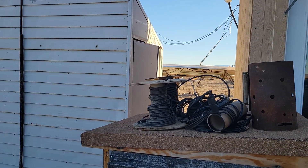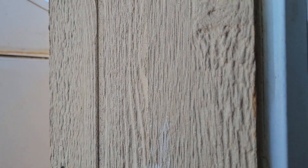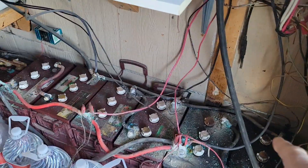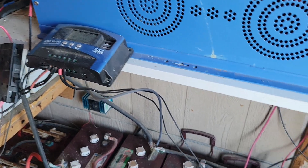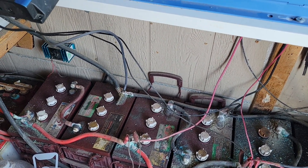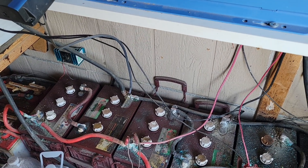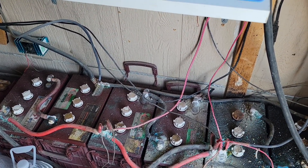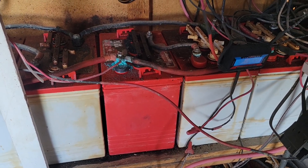We're coming out here to the battery room. I need to get in here when the weather breaks a little bit and clean all the battery terminals. Somebody gave me a great idea — instead of the spray terminal stuff, use that plastic dip rubberized coating. Clean the terminals off really well and then coat them with a small paintbrush to keep corrosion from spreading. I'll video that when I do it.